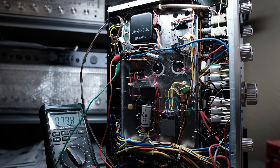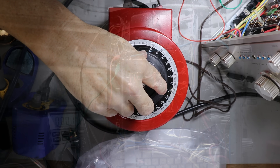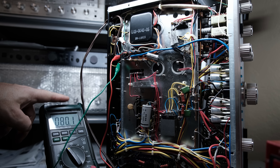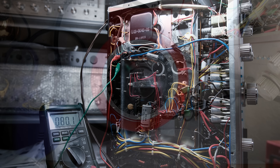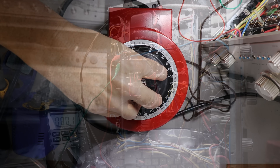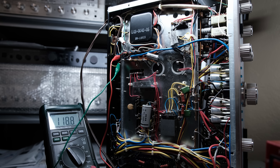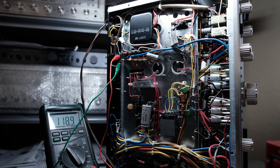I'll give it a few minutes at that voltage. I'm not going to wait hours or days to reform electrolytic capacitors because frankly they're all coming out anyway. A variac is fairly inexpensive — a 20-amp model runs $70–$100 on eBay and will satisfy most vintage audio equipment. I'll go right up to 120 volts — about 118–119 — and she looks like she powered up fine on full line voltage.